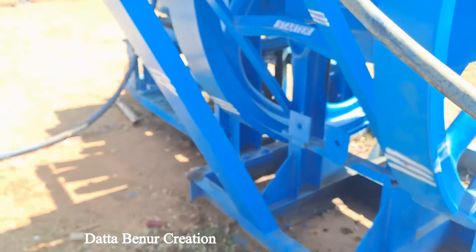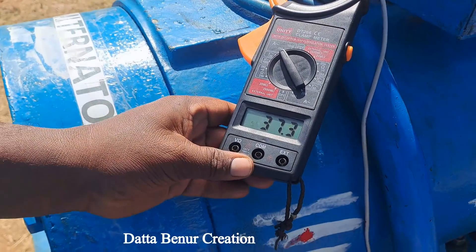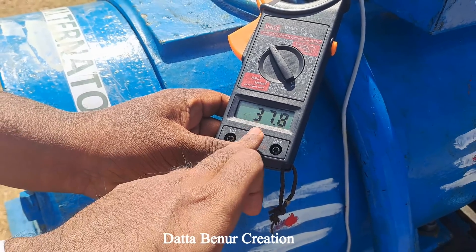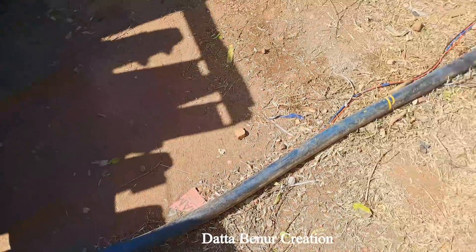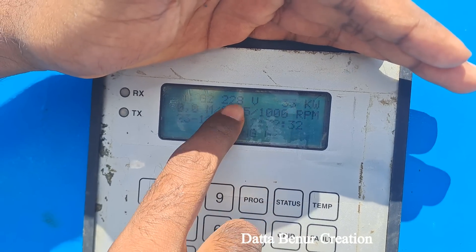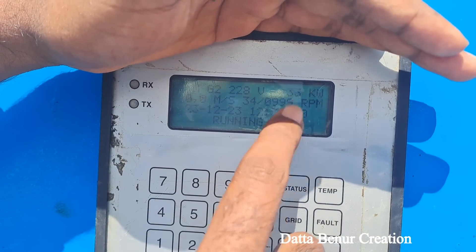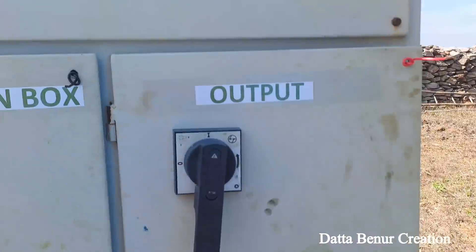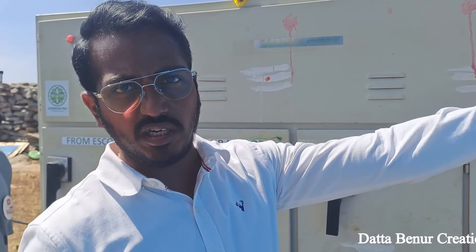But look at the output side. The input is zero, but when you look at the output, it is actually producing about 37 to 38 amps — sometimes it goes up to 40, depending on the voltage. So these are the amps coming out, showing that power is being generated. Now the output flows from here all the way to the distribution box. Here you would see the kilowatts being produced — right now it is showing 228 volts and 33 kilowatts. Sometimes we get about 250 volts and the kilowatts increase. The power generated goes back through this thick cable into the bus bar and into the distribution box. To demonstrate output, we have connected it to a particular motor at the back — please come along, let me show you.